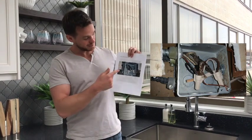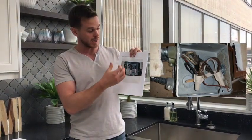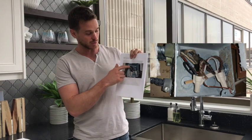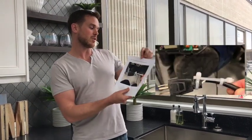What's wrong with this photo? To me this looks like aluminum wire tied into copper wire. Because one runs a little bit hotter than the other, this can cause an electrical fire. Also, the sheathing on this wiring looks exposed, which can also be very dangerous.